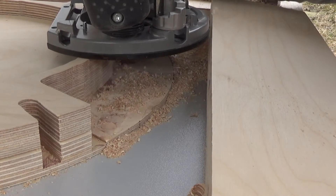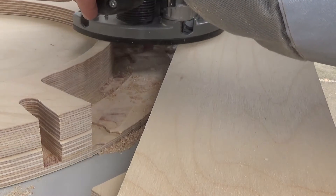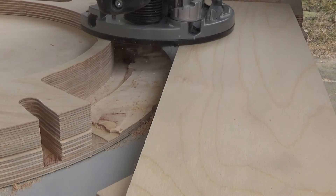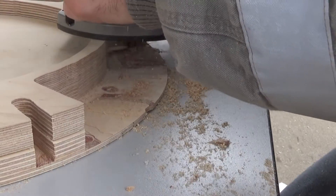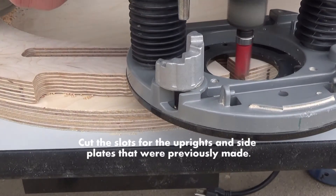The step-down on the router actually has about eight different settings, so it does take a little bit of time to get them all cut down. You see sometimes that board slips out — it's good to have the backing under that, which would help; I did not have that so I'd advise doing that. You can see it just slowly routed down until I'm at nothing but the base of where I needed to go for the data port.